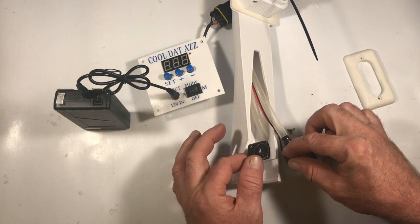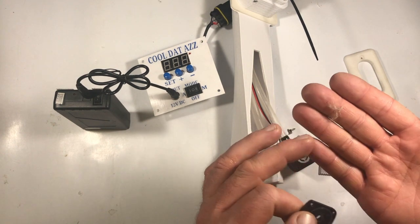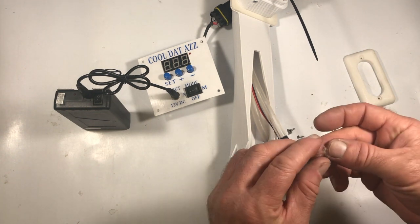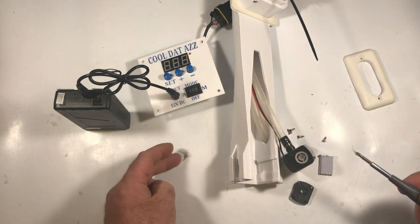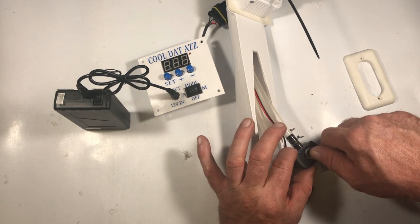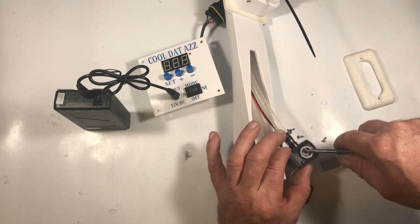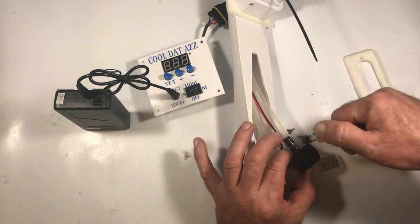The main enemy to the pump is just buildup, gunk and mineral buildup inside. So look at that, we got a feather, it looks like a bunch of fuzz, maybe fur or something inside there. Maybe that was obstructing the impeller. Usually it takes a little more than that, but we'll take the impeller out and see what else we have in here. I'm just taking the screwdriver tip and getting it underneath the side of that impeller, or the spindle, whatever you want to call it.